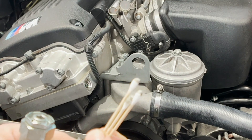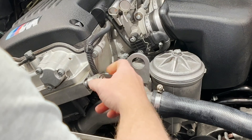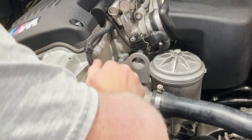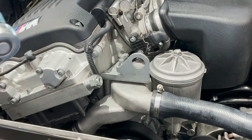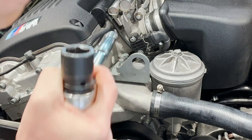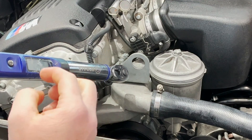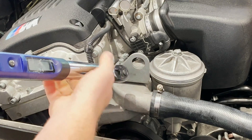I've already cleaned here with a little bit of brake clean on some Q-tips. Here are the three Q-tips I used — that's how much dirt I got out. Good, I didn't feel any binding. We're going to torque this to 20 foot-pounds. You can see everything is put back together, but I still have an O-ring I ordered coming from Pelican — I'm just not comfortable with the teeniest of nicks. Vaseline is your friend when installing those O-rings. Torque to 20 foot-pounds and you are done.